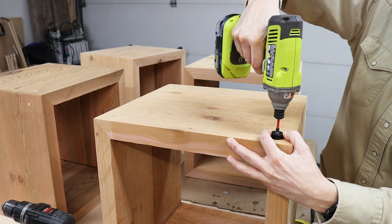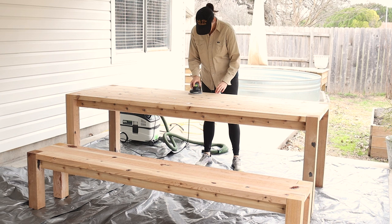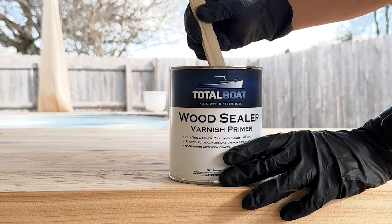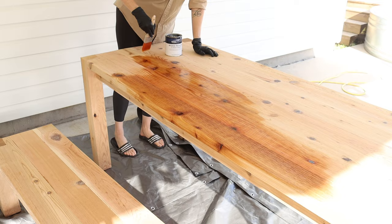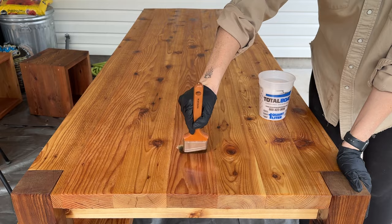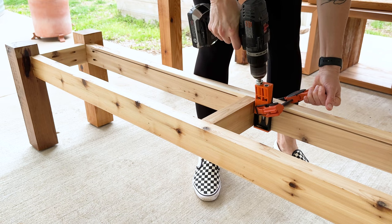Just like on the table and bench, I'm adding rubber feet to the bottom of the stools. For finish, I'm using TotalBoat products on cedar — the same recipe I used on my outdoor shower. First I'm applying TotalBoat's Wood Sealer Varnish Primer, which fills the wood grain, seals the fibers against moisture, and protects against the sun. Over time cedar turns gray, but this finish keeps mine the original color. I then applied a finish coat of TotalBoat's Halcyon, which works well with the previous wood sealer, provides great UV protection, dries fast, and is a clear finish.